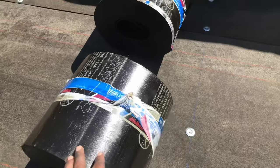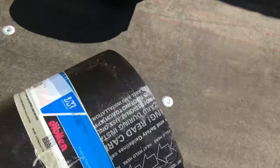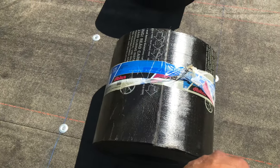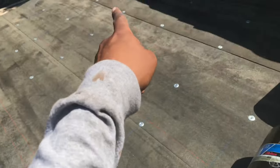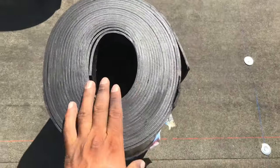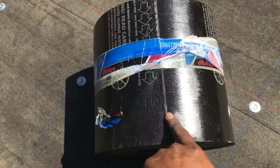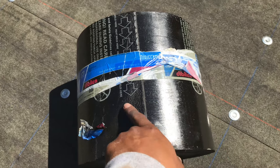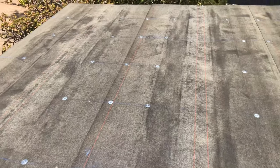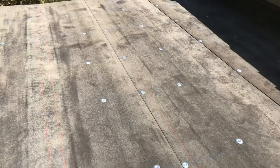I have another video that has two layers of smooth. This is smooth - it doesn't have any granules or rocks, just pure modified bitumen. It's a little roll we install as well as underneath flashings or underneath the drip edge around the edges, so you can sandwich the metal. It's not a peel-and-stick membrane, it's torch-applied. You put a blowtorch or flamethrower, heat this up, it'll melt and stick onto the base.